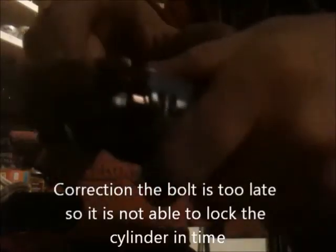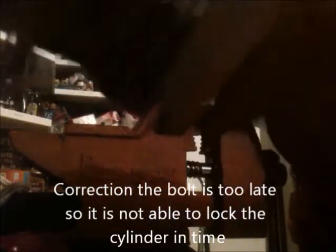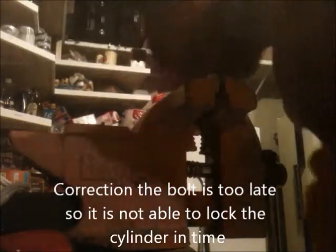So, what have we learned? Why is it? That's weird. So yeah, we're learning one of two things. The bolt's coming up way too early, which means the hand's too long. The hand keeps wanting to push it back, so that means, what? It's way too long. So, what do we do? Well, great question. We're going to shorten this. The hand.